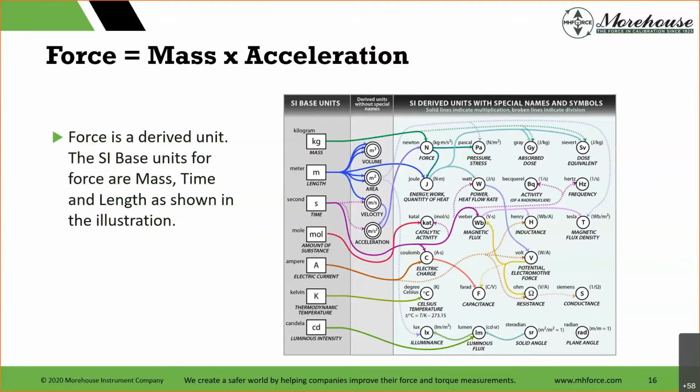You buy a torque wrench, it says Newton meter, and then most of them say foot pound. Well, foot pound is not torque, that is energy. So my pet peeve here is it is force times length. So we should always see Newton, the force first, meter, the length second, and we should see it as pound feet, right? Force times length, pound feet. I don't know why manufacturers did that, but next time you look at a torque wrench, you can start wondering why it doesn't say meter Newton if they want to invert them.